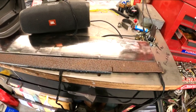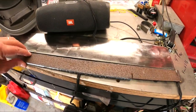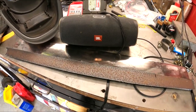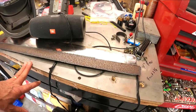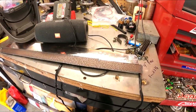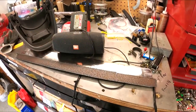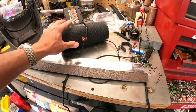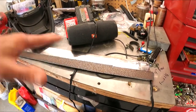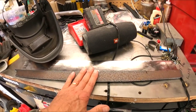I've got to trim this down, mark it, change my saw blade, cut right there, and weld that up. I'll hit it with the grinder quick. I'll set it up in there, try to get my angles right, maybe tack weld it in two spots and then bend it to where it looks good. I also have to be very careful welding this front piece so I don't warp the back plate, or it's never going to sit right. Once this angles up it stiffens the whole structure and keeps it from wanting to bend anymore.